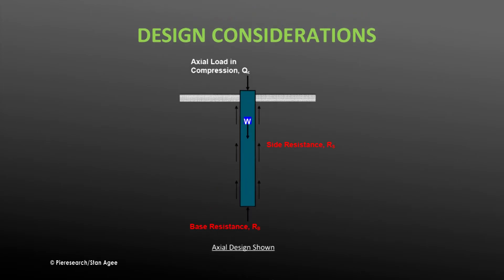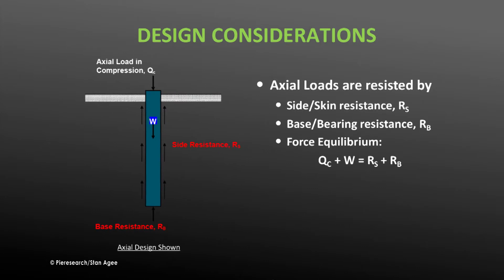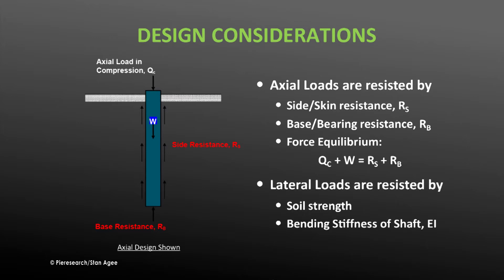Designers rely on foundations to hold buildings up or down. The reinforcement inside a deep foundation holds it together and strengthens it to full capacity. The location of reinforcement behind concrete cover protects its integrity, primarily against corrosion. As loads are placed into foundations, they are transmitted to the soil through friction of the pier and surrounding soil and through pressure against the bottom of the shaft. The pier acts like a column inside the soil to carry force to the bearing end. When subjected to tension from high winds or earthquakes, a straight pier shaft resists uplift through skin friction. If the shaft is belled or under-reamed, the entire shaft can be in tension during storms or earthquakes, as uplift forces are restrained by the bell at the bottom of the pier.